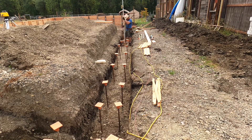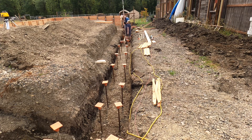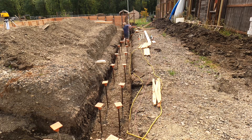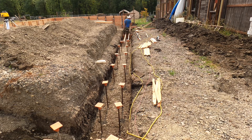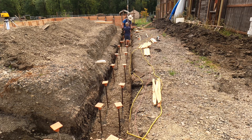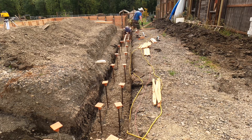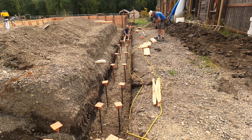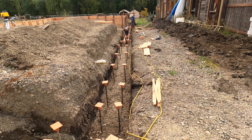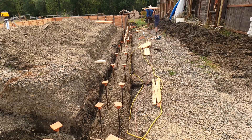Here me and my helper are on the other side. Starting at the corner, I chose to start at the high spot — I just feel that's the easiest — and my helper is checking to make sure it's to grade as I'm bringing it up. I am working on both sides for just the first two board heights so it carries me up to that next step in the footing. I like a half board then a full board, half board, full board, continuing up — that's the inside form — then carrying it on over to each step.